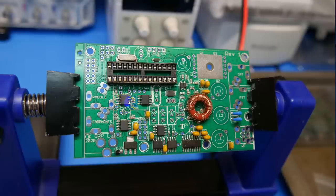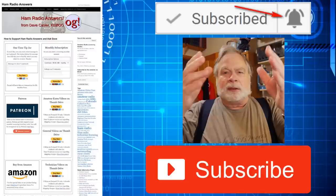You can see the board right here — these are actually surface mount, not through-hole components. There are different pitches for surface mount components. The master oscillator here has a very small pitch. These larger-pitch ones are op-amps. This is a voltage regulator down here, and then there are tiny capacitors and resistors in here that you really need a microscope — literally a microscope — to look through in order to work with. That ends our tour of what we've done today and gives you a few hints about things you might want to get for kit building.